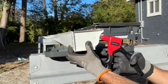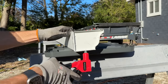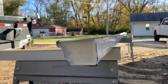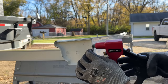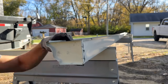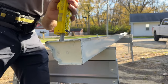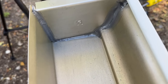There is also a crimper tool — the link below the video will show it to you. It comes in super handy but you can also do it with rivets like I'm doing here. For the last end cap, same process: press it in, use the hammer, and be precise with your drilled holes since you don't have much of a lip to work with. You want the rivets to fully seat and pull everything together. On the inside, apply a generous portion of sealant, tooling it smooth to make sure there are no gaps for water to escape.